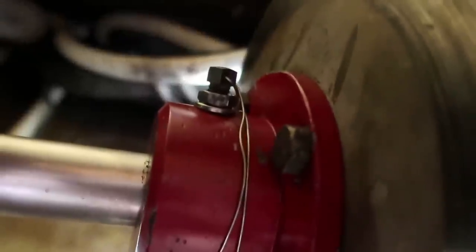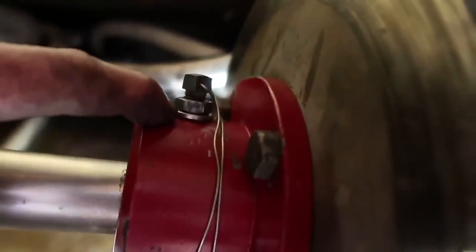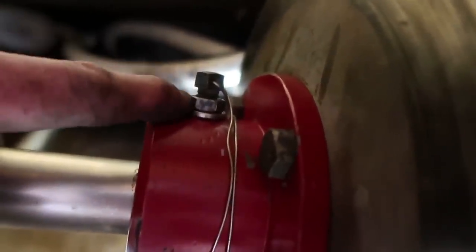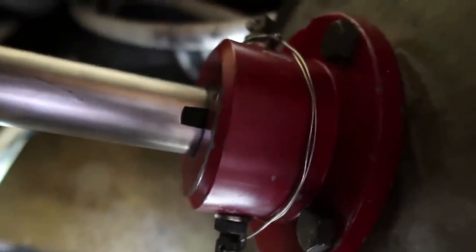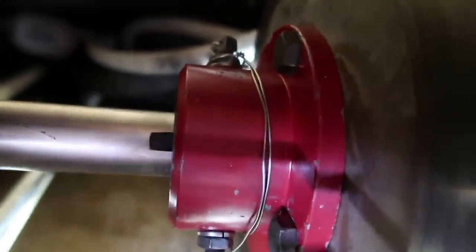And then these bolts, which are actually locking the shaft into the coupler. So this has a lock washer, it has a second lock nut, it has blue Loctite on it, and I've safety wired these upper bolts against the rotation of the threads. And then finally, there is a shaft key that is down in that slot, holding it all together. Okie dokie. So I think that is pretty much good to go.